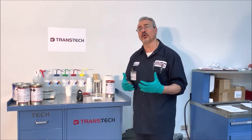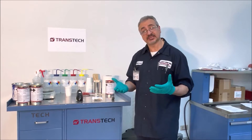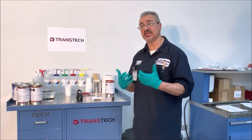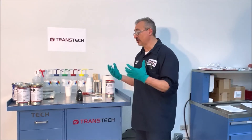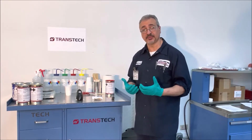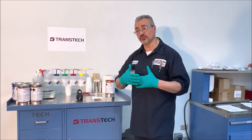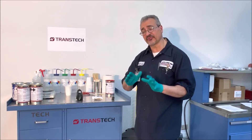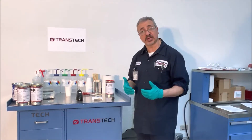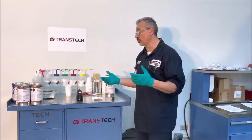This portion of the video is to show you how we know when an ink is actually working well. You have to go through some testing. The testing criteria is knowing what to do ahead of time with the ink mixing and to be able to test the ink on your product after you've printed it. You set some parts aside — print maybe 10 of them — and make a matrix to test parts at different temperatures and different times.